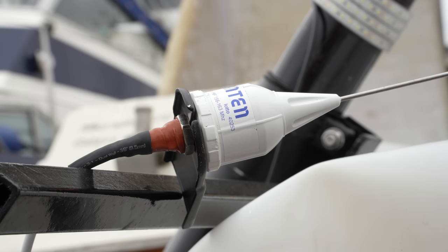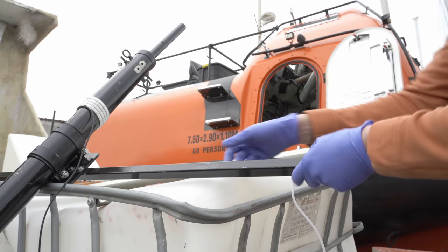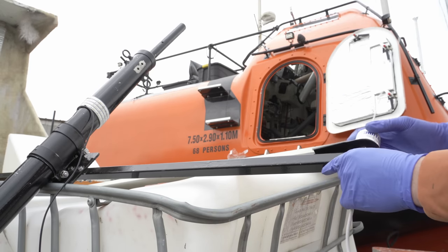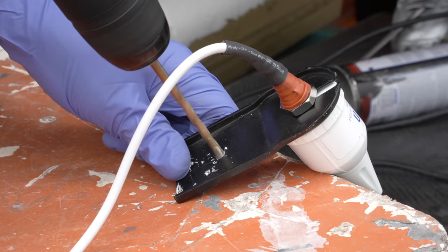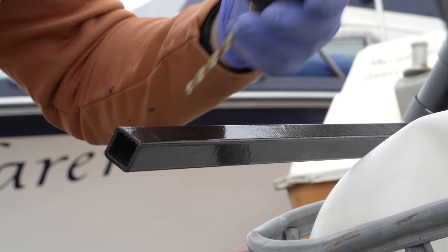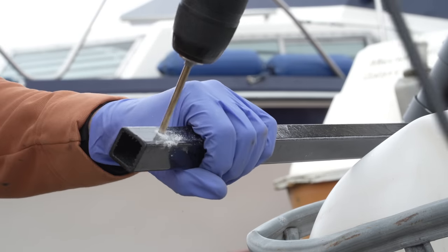Then onto the VHF antenna. I'm putting the antennas right on the ends, although keeping in mind I do need to add a ring anchor near to the span ends, so I can stabilise by running a tensioned wire rope down to Alan's shell. I did, as I mused before, flatten, cut, and then repaint the supplied antenna mounting arm. It just needed a 5mm hole drilled to allow me to attach it to the corresponding hole in the glass fibre box section. I'm not going through all the way and bolting.